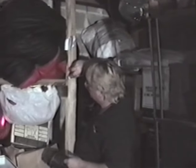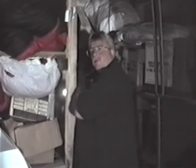After you've walked around doing your bottom plate that's on top of this concrete, what you want to do is come into your remote areas, turn on your flashlight, and basically check everything, including your built fixtures and your shelves. These fixtures in here, you want to check and make sure that where they meet the ground, any place that they meet, you get in there with your screwdriver and make sure that there are no rotted areas. And remember, always get in the tight corners. Always get into the places that are hard to reach.